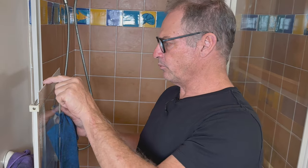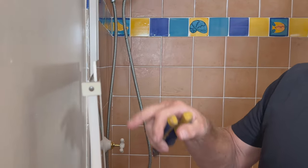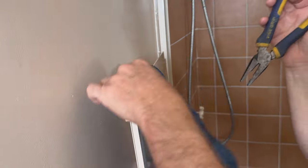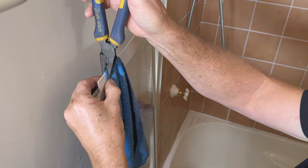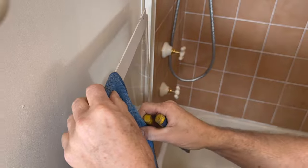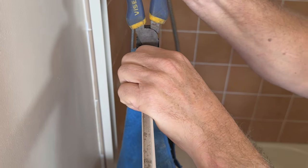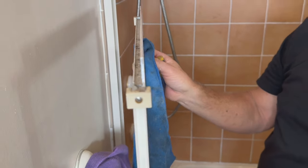Taking the rollers off — eyeball down the top of where the rollers go on the top plate. You can see it's just out, so basically the pliers will go on and this will bend it over. I'm going to put a microfibre over the top so I don't scratch the powder coating. Put the pliers there and give it a quick tweak back so it's not flat. I'll do the same thing on this one — microfibre again, pliers over the top, over the holes, give it a quick little bend. And that's pretty much as good as you're going to get on this particular shower screen.